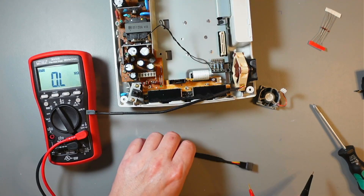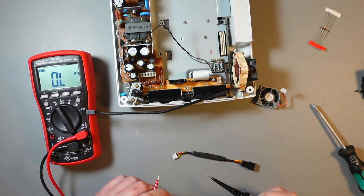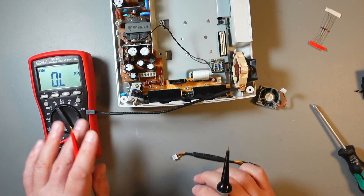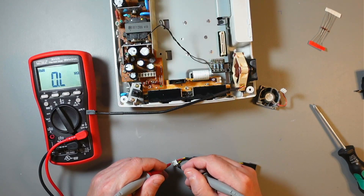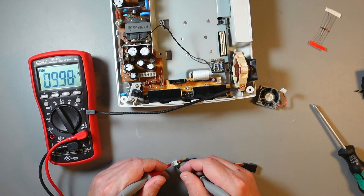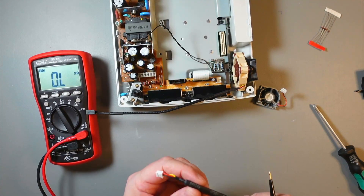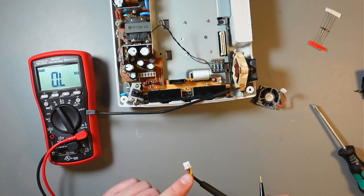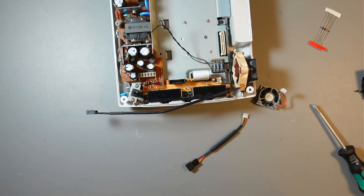I realized I had no audio for a while. Let's check if there's a resistor in the fan cable - there should be a 10k resistor between the red and the yellow wire. Using the multimeter on red and yellow - yes, there is a resistor there. So if you're making this cable yourself, make sure you have a resistor between the red and yellow wires, otherwise it just won't work.